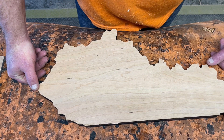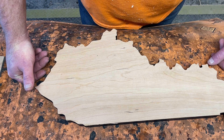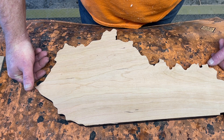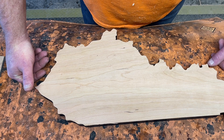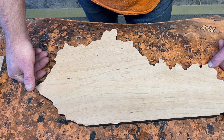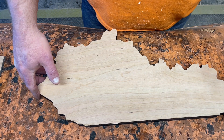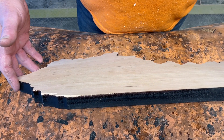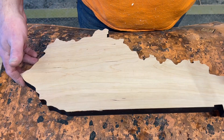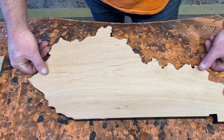Hopefully you'll take something away from this video. The four-inch American Photonics lens partnered with the Thunder 51-130 will cut through right at about an inch at four millimeters a second and 90% power. I figure if we slow it down to one or two millimeters a second, it'll probably get all the way through with no issues. I wouldn't hesitate purchasing either the laser or the lens. Leave a comment and have a great day.